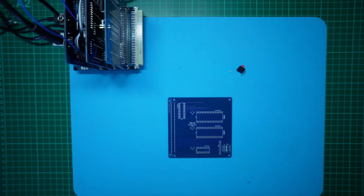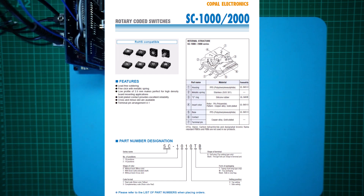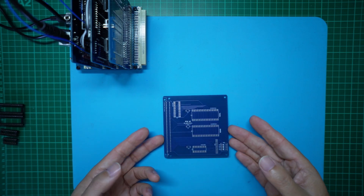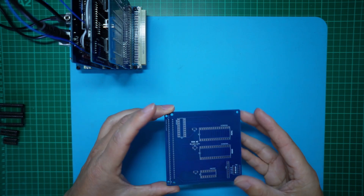I only recommend using genuine NIDEC Copal Electronics rotary coded switches — for this project specifically the SC-1130. These are much more expensive, but I have used them for years and they are genuinely good quality. Of course you could just use a simple 4-way dual inline switch. So with that covered, let's take a look at the finished circuit board.